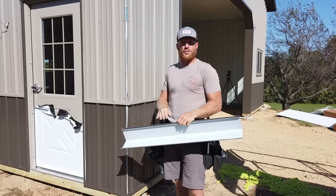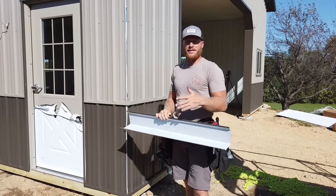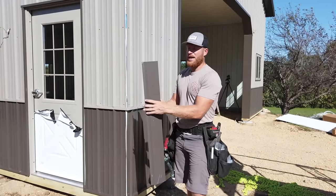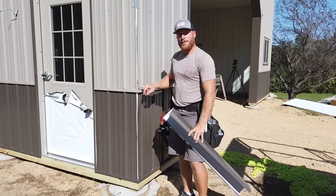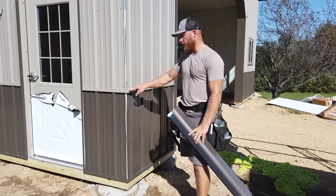I've never actually really taken you through an in-depth tutorial on that, and I'll show you how we make it look like a seamless one-piece corner. So first, I've already cut my bottom and I cut it to the dimension measured from the bottom of my base trim and I give myself about an inch over the top of my wainscote transition Z flashing right here.